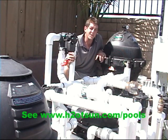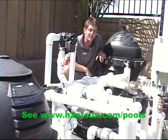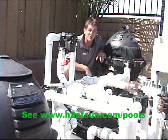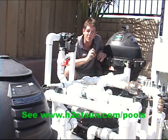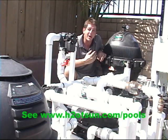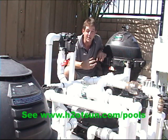What happens if the pressure is higher than the height of the roof? In that case, the first thing we try to do is reduce the pressure so it's lower than the height of the roof. You either enlarge the inlets where water goes into the pool — sometimes those are eyeballs, sometimes they can just be removed, or you can reach in and file them out with a round file. Sometimes we'll tie solar in downstream of the gas heater where the pressure is 5 psi lower.